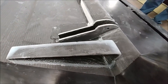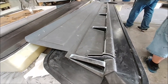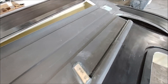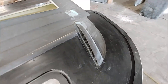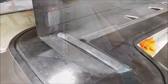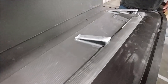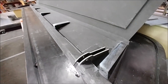Here Jeff's getting ready to close out the rudders. The hard point he put in last time has been trimmed off and finished, and the hole for where the rod will connect has been put in as well. This is just a last look at the inside of the rudder before the two pieces get bonded together — and there's the other side — mainly so we can see exactly what's in there if we ever need to know how it was constructed.